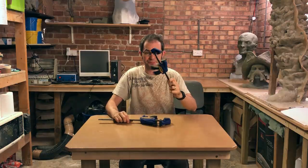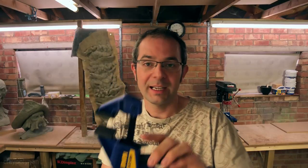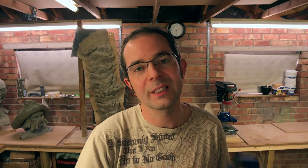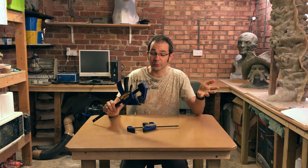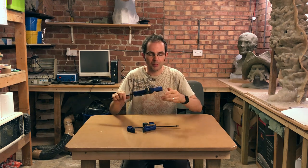Number four are these guys — quick release or quick grip clamps. I've got various different sizes: large, medium, and some really small ones over there. They have a release that means you can slide them up and down, and a pump action to quickly hold two things together. These are actually what broke, which made me do this video. These new ones have some added benefits — you can easily take the top off to get through holes or tight spaces before popping it back on to clamp something. Quick release clamps: massively useful.